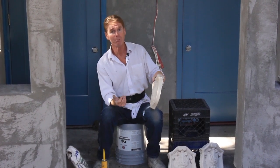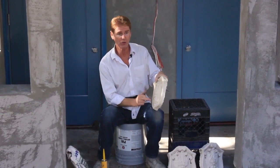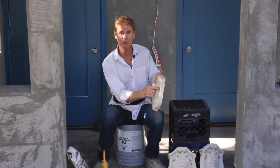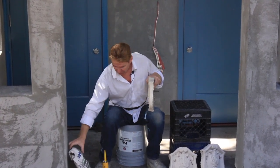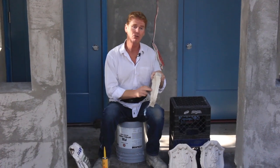I told the contractor: if it were me, I'd drill four holes, pre-drill them, and then pre-drill a countersink. So when you set that screw in here, it'll hold them. And here's what I'll generally use when I install them.